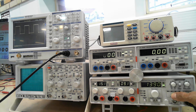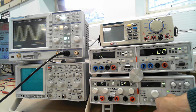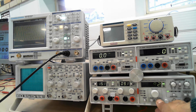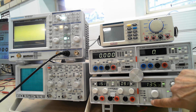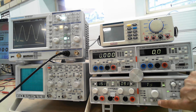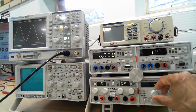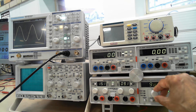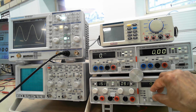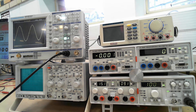If you press this, you get triangular waves. This one is square waves. This is pulse width modulated waves. So if we go back to sine wave, you can set the frequency using this. These buttons here will cycle through the frequencies very fast, but if you want fine control, you turn this knob here. We'll set it to 1000 Hz. So we've got 1000 Hz coming out, and it's displayed here on the oscilloscope.